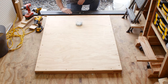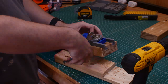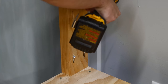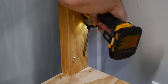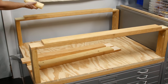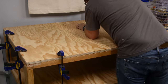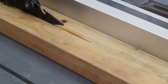That second red drill you see is the first drill I ever bought — it's still good for countersinking holes so screw heads don't stick out of the plywood. It's really nice to have two drills handy with a regular bit and a countersink bit at the same time. For the vertical supports, I opted for pocket holes rather than fancy joinery. I used a pocket hole jig to drill pocket holes in all four supports and then screwed them into the base. With the supports in place, I dry-fitted the top frame, glued it, and secured it with more pocket screws before screwing on the top plywood.